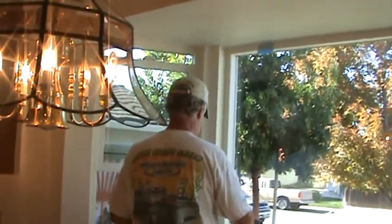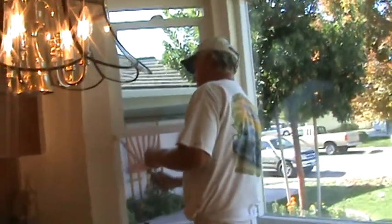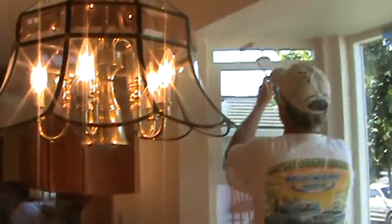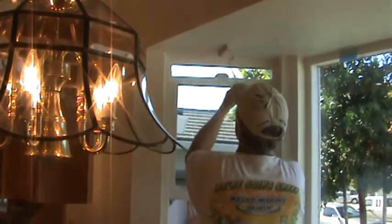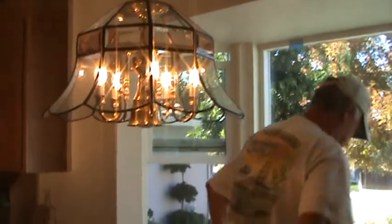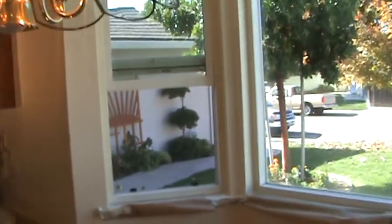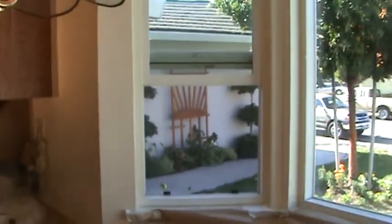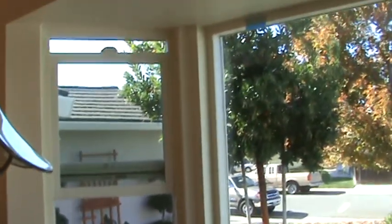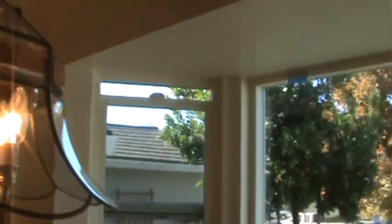And that's the thing — did you hear what he said? A small, tight bead. I don't know how many times I've seen around windows where there's a big, fat, ugly bead of caulking. Well, when that caulking dries, it's not necessarily the same color as the paint, and you see it all the way on your wall and it doesn't blend in at all. Or you see the edge of it because it didn't wipe enough off. Small, tight beads around your windows and you'll be good to go.